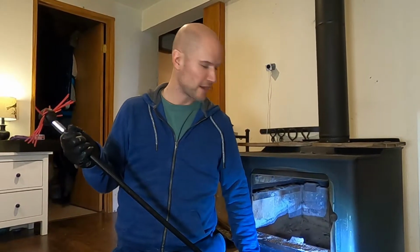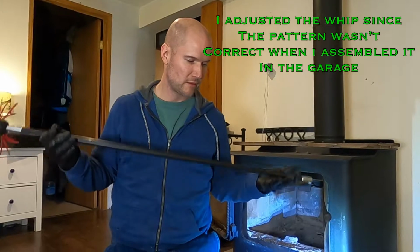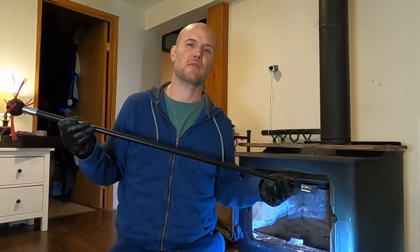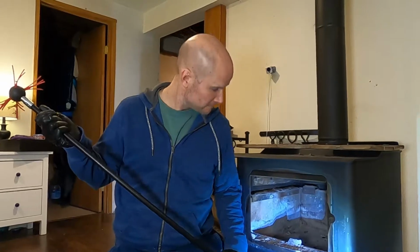All right, so we're gonna try going in. This comes with 6 3-foot sections. So when I took the flue apart normally, it would get me to the vent cap on the top. So it's gonna come up a little bit shy, but hopefully we'll be able to pass those little 45s and make this work from down here. It'll be great. So I'm gonna try.